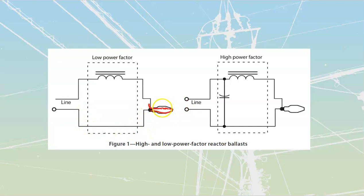How much resistance does that arc have? Well, it does not have a lot of resistance. Once we ionize, we create a conductor, which means that there's next to no resistance across that ionized path while the path is in action, which would mean that we would need to drop the rest of our voltage someplace else. That's where we place one of these in there, an inductor. That inductor that we are going to place inside of there is going to limit, or choke down, the amount of current that I'm going to have inside of here.